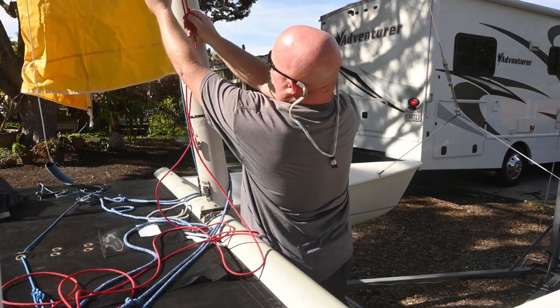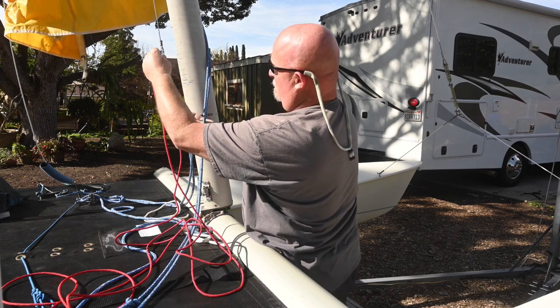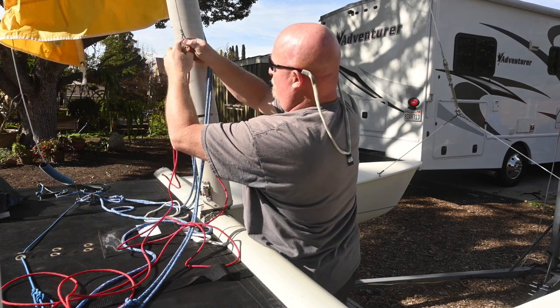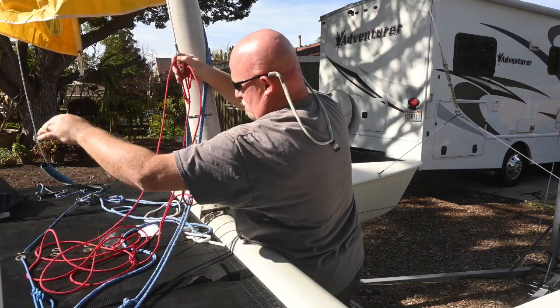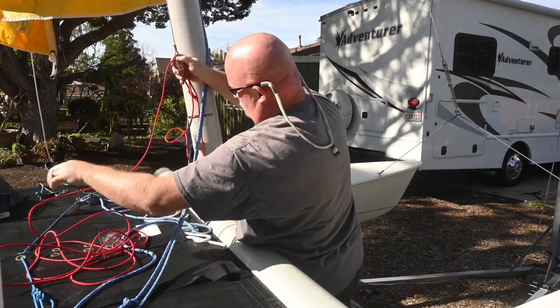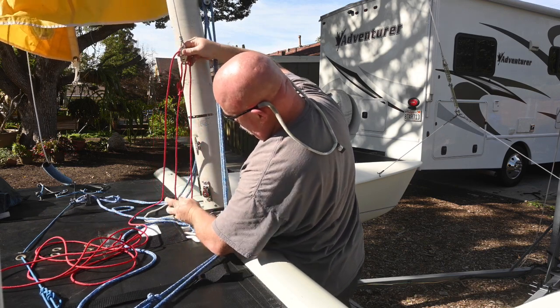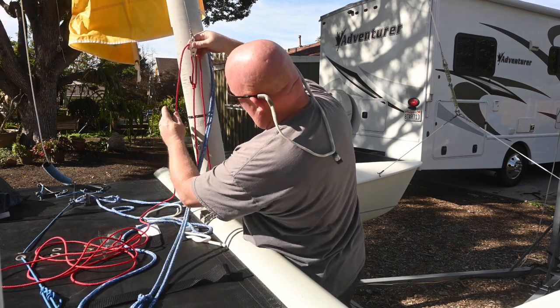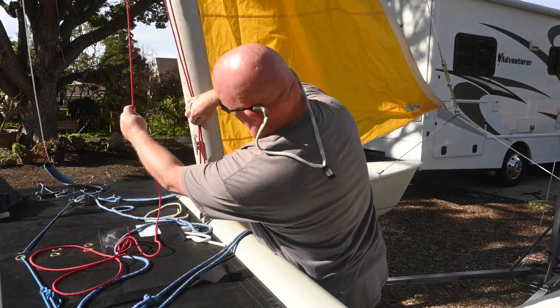The rope portion of the jib halyard is attached to the bottom of the jib block with a bowline. And then what you want to do is bring the bitter end back up and over the sheave in the block, so you've got a loop. You're going to put that around the cheek block at the base of the mast. And you can tension it there and get the mast in the position you want it, and then cleat it off.